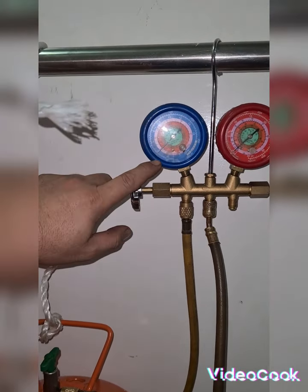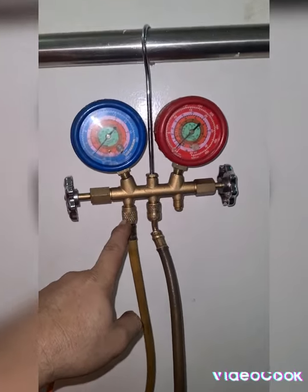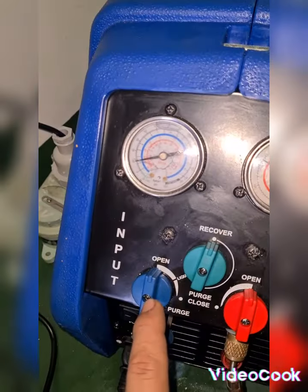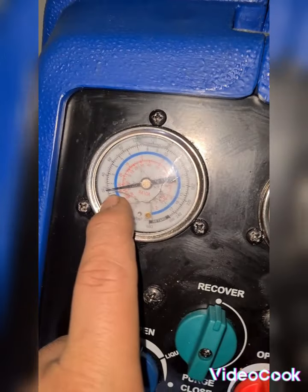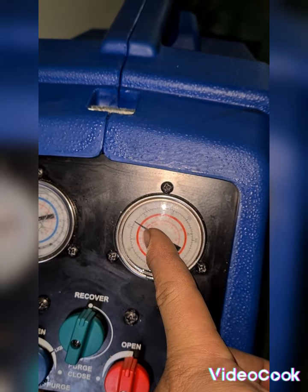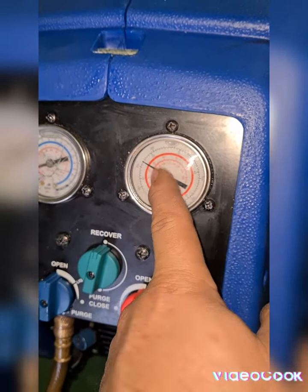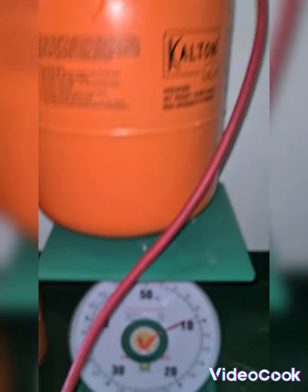As you would notice the pressure of my manifold gauge is about 2 bars, from this tank going to the manifold gauge. From this point the process is going to the input of the recovery pump at about 0 to 1.2 bar. From the output of the recovery pump, before I had 20 bars but now it's getting lower to only 17 to 18 bars.